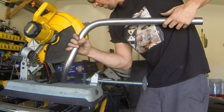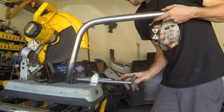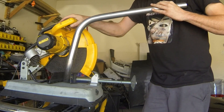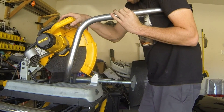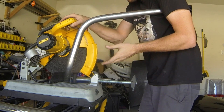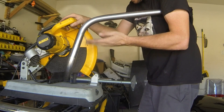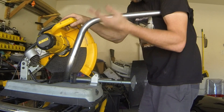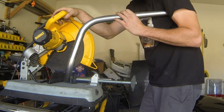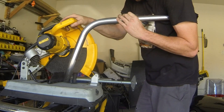This is one of those moments where you kind of need to be at one with your skills and really trust them, because if you don't, you're either going to hurt yourself or make this cut incorrectly — neither one of those is a good thing. I do have faith in my skills so I'm going to have a go at this. Now if you're not confident in your skills, don't have a chop saw, or whatever the case, you can absolutely hold the tube up, trace around at the angle it needs to be cut and cut it by hand — with a reciprocating saw, a cut-off wheel on a grinder, or a hacksaw in a vise. Whatever suits your fancy, just try to get this angle as correct as possible. I'm going to see if I can nail it right here with the chop saw.